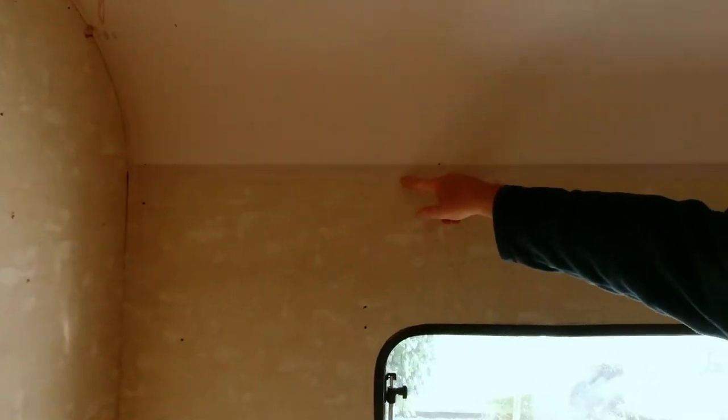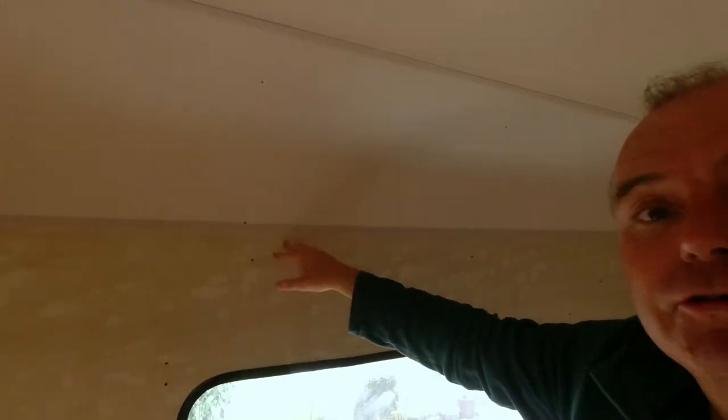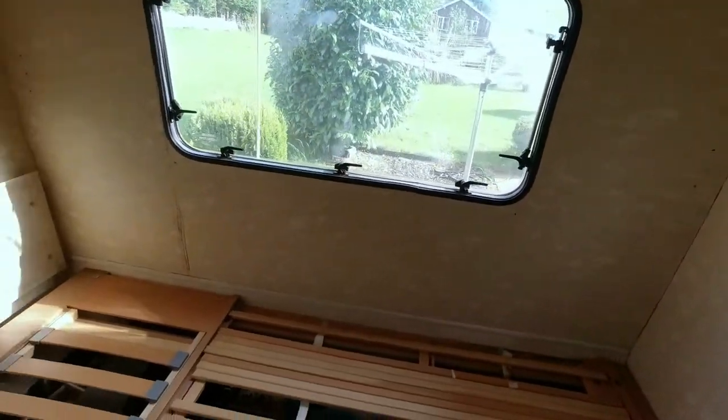I thought the damp only came three quarters of the way round, but having taken the shelf down it's following right across the edge of this beading all the way across. When we get to the outside to repair the beading, that's going to need loads of sealant. I'll also check the joint internally once we get into that cavity. The plastic coated ply sheets will need to be replaced. I also noticed bubbling in the plastic at the left hand corner — water's gone into the ply sheet and this plastic doesn't breathe.